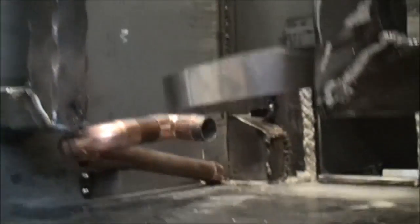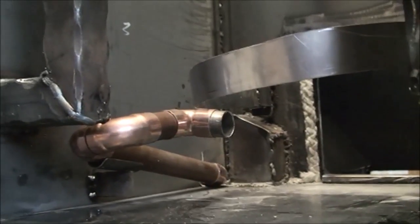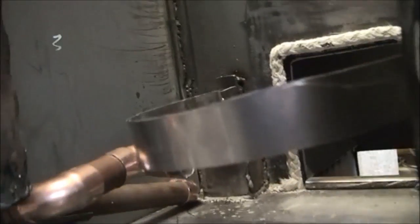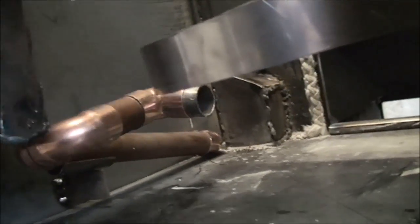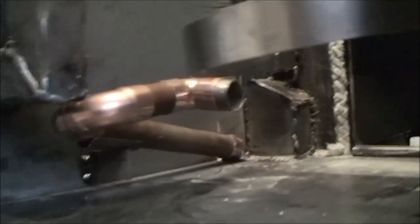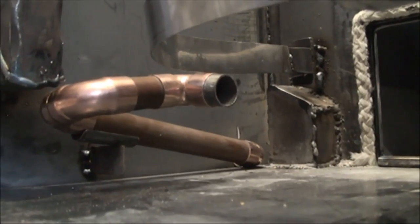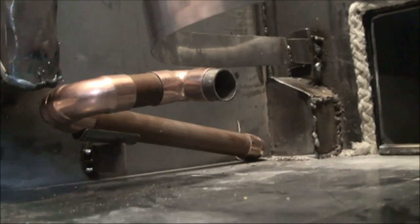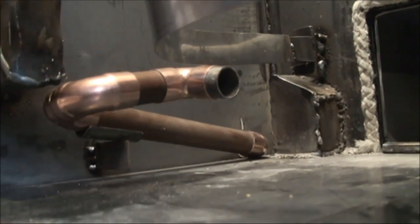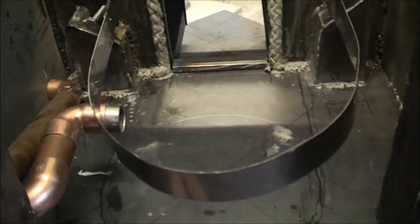That pipe is rising all the time as it comes in, because I don't want back-feeding — I don't want the air volume and pressure inside the riser to be pushing air out of that pipe. From other stoves I know that as long as that pipe is rising, the heat within there will be rising, so the heat in there will be a positive force going into the riser tube.